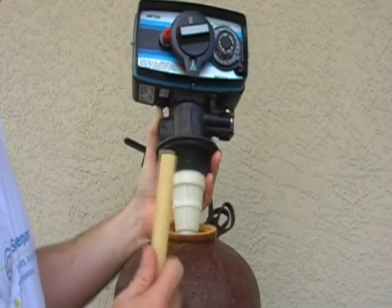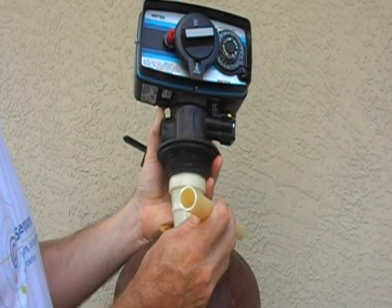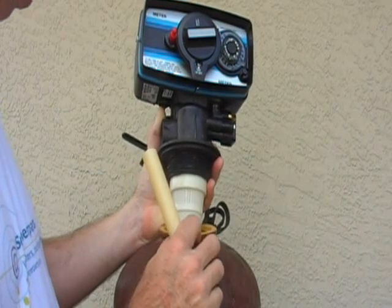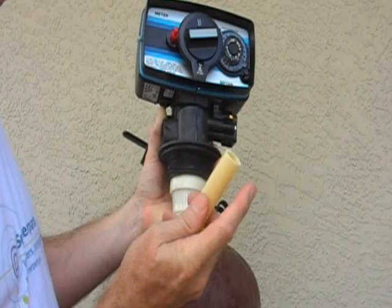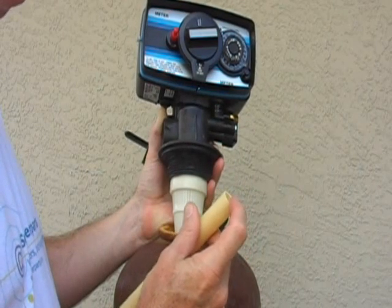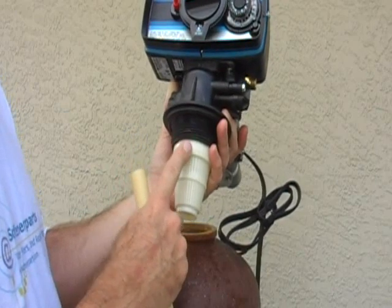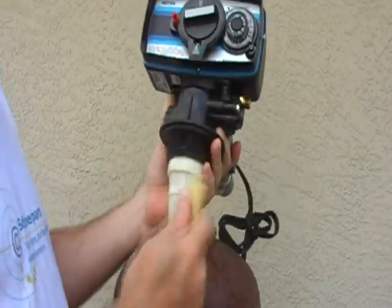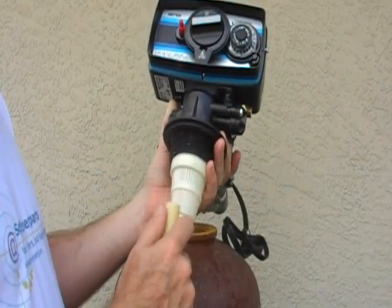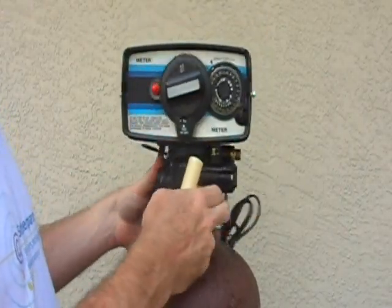So, whenever changing a valve, make sure that you replace the old 13-16 with a 1.05, which happens to be the outer diameter of schedule 40 three-quarter pipe — the three-quarter refers to its inner diameter. You can also make an adapter: that schedule 40 pipe will slide right on top of this. Take about two inches of schedule 40 three-quarter inch PVC, glue it on top of your old pipe, and it will snugly fit into the valve. There's also a rubber bushing that goes inside and allows you to use your old pipe. We recommend replacing the pipe when changing the valve if at all possible, and we will include the upper and lower basket so you can make a whole new pipe, stick it in your tank, and everything will be the correct dimensions with a solid seal.